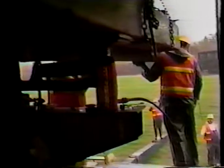The removal of the old pile cap involves readjusting the crane's boom line several times while the pile clamps and rollers continue to bear the weight of the beam. But once the line is to the midpoint of the beam, the operation moves without pause or hesitation.